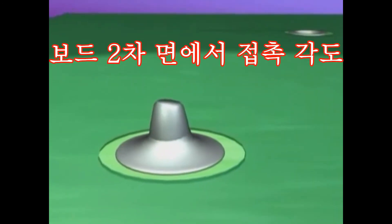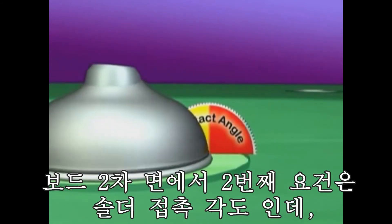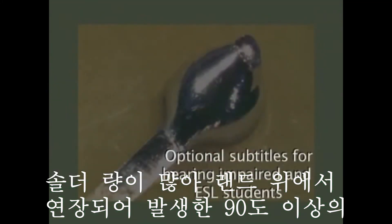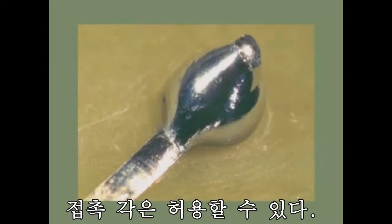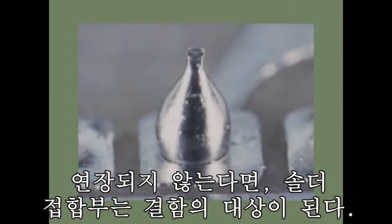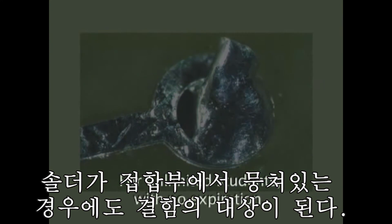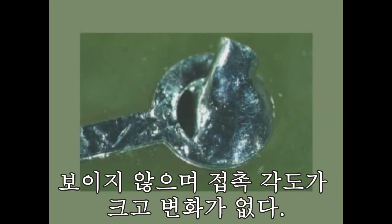The second requirement for the solder side is contact angle. The ideal solder fillet will form a contact angle of 90 degrees or less. A contact angle of greater than 90 degrees is acceptable when the cause is the quantity of solder extending over the land. The solder joint is considered rejectable when the fillet is convex and the contact angle is greater than 90 degrees but solder does not extend over the land. Another rejectable condition is when the solder clumps on the surface of the connection, with no feathered edge apparent and the contact angle is irregular.